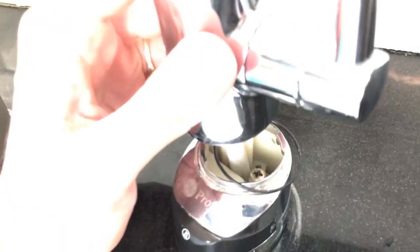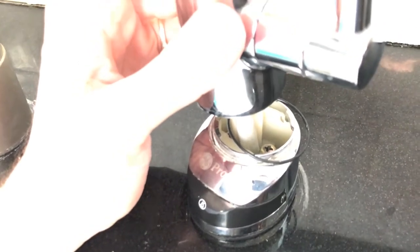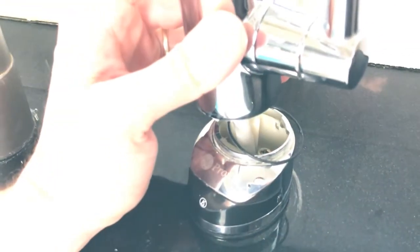In the event that yours is making that sound, look below the sink because chances are it is leaking and beginning to create a puddle of water under your sink. What you want to do is shut off the water to the reverse osmosis system.